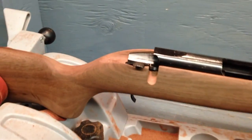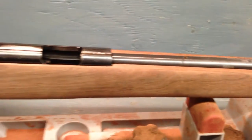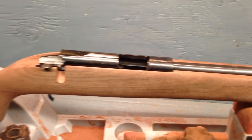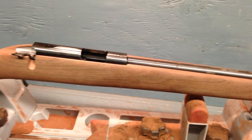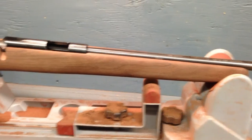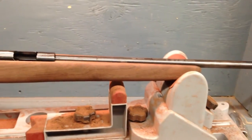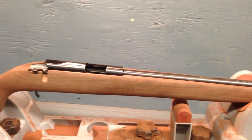I inletted around the safety — I think I did a really nice job of that. While the action was teetering right where the receiver and barrel meet, it was a little high, so I used a quarter-inch wood chisel and cut just a little bit of material out of there — and it doesn't rock or teeter anymore. Then I took some 100-grit wet sandpaper and sanded down the bottom. I still have some 220-grit sandpaper to smooth it out. I had to take a little bit off so the screw would start for the trigger guard, and it does — it seats nice, about four threads. That's perfect.